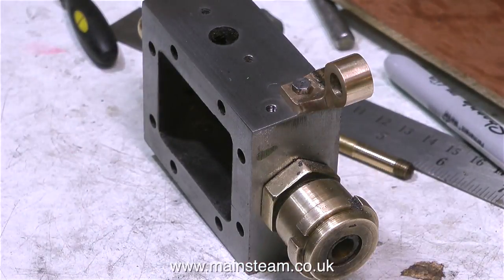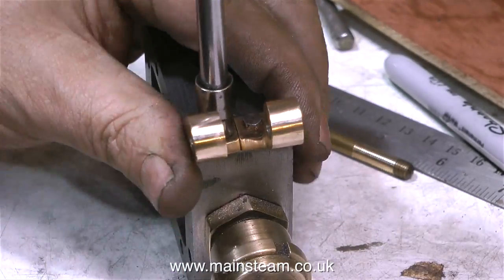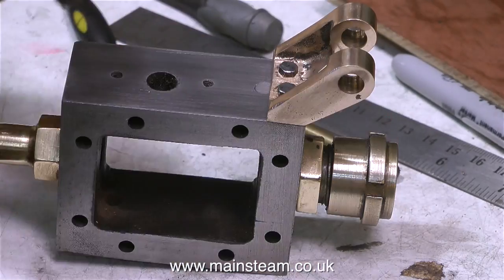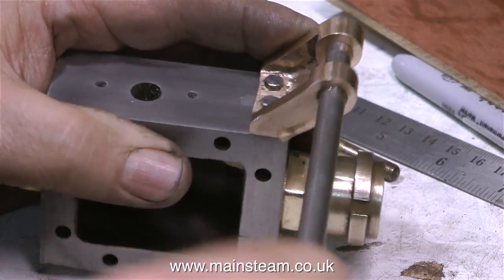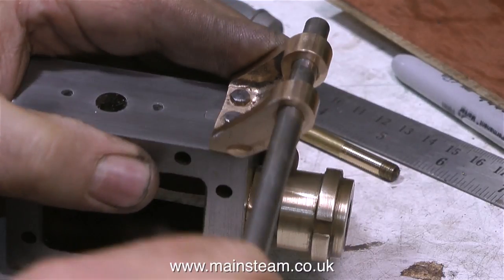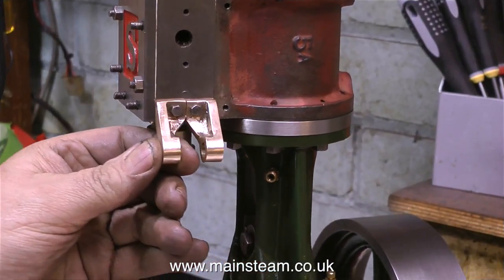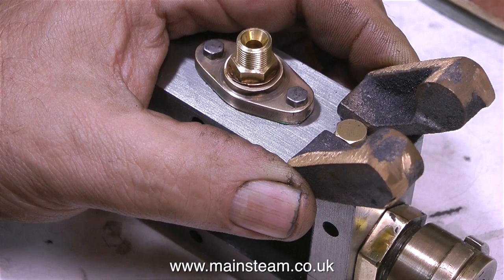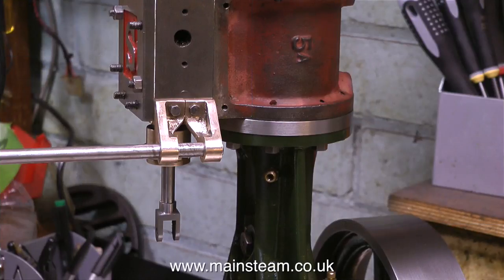Because all the surface dimensions were done on the belt sander when the part was one component, and the holes were also drilled at this time, the part is very accurate for its intended purpose. In order to fit this bracket to the steam chest, I had to plug up the hole that was just above where the bracket fits. After the bolts holding the bracket were fully tightened and the bracket was secured to the steam chest, I lubricated it with some machine oil and used a piece of 5/16th stainless steel to make sure that everything lined up properly. Shaping this bracket and drilling the holes took over two hours.